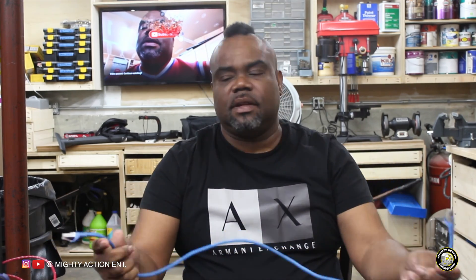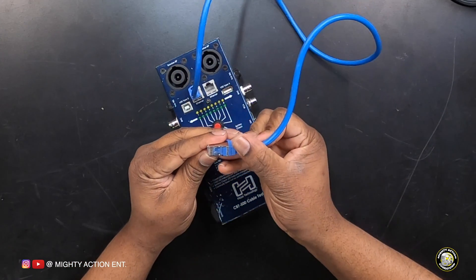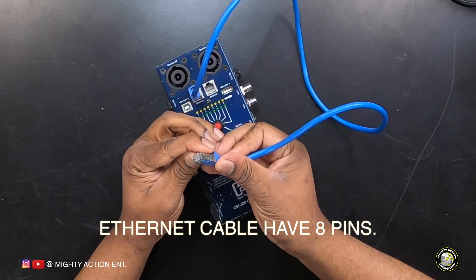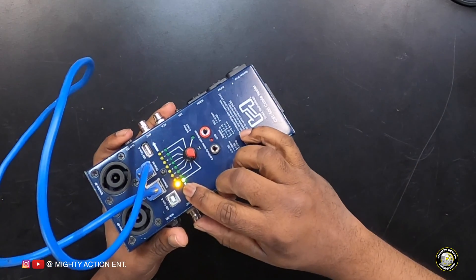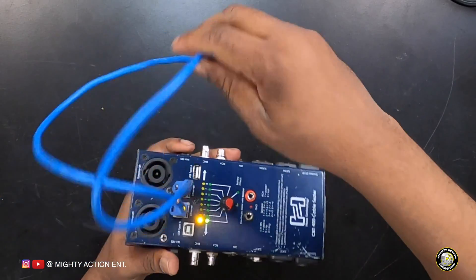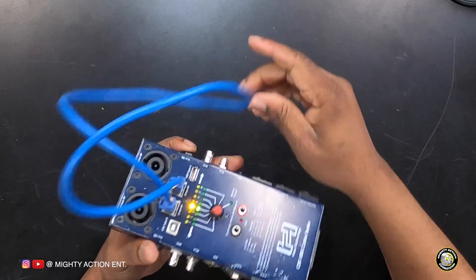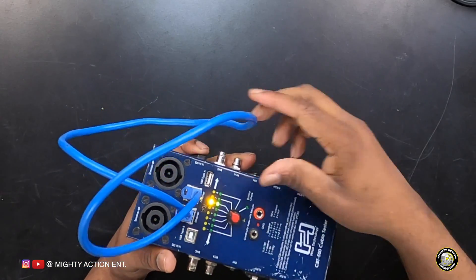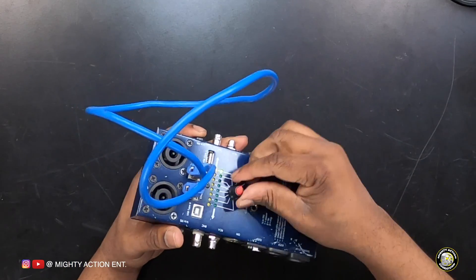I would check an 8-pin conductor but I'd have to go to the truck. Before I do that, here's an old Ethernet cable I don't use anymore — let's see how good it is. Looks like about eight pins. Instantly pin one comes on — both green and yellow, no problem. Shaking it around — no issues. Two, no issues. Three, four, five, six, seven, eight — all good. This Ethernet cable is good.